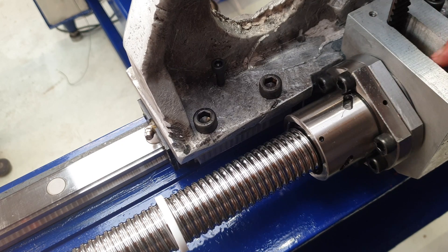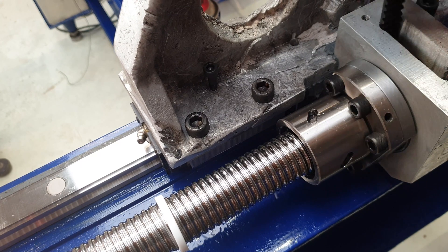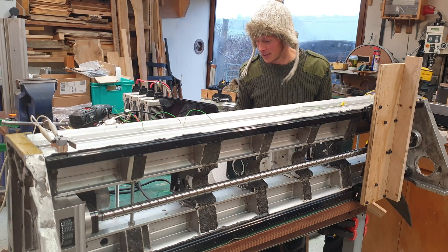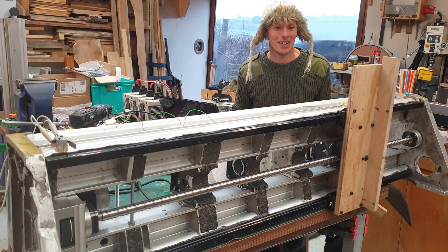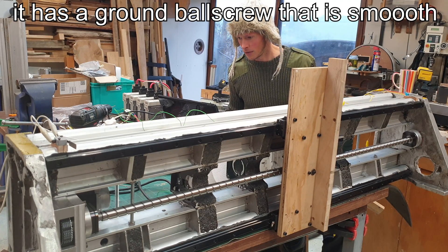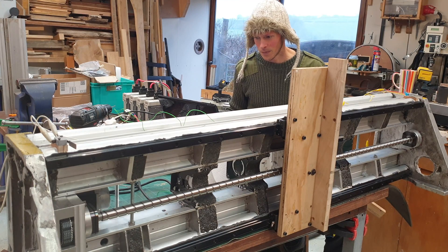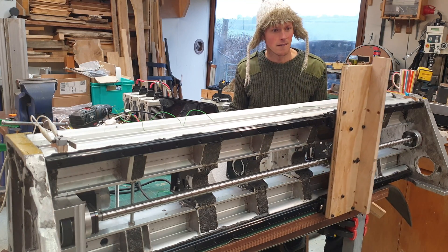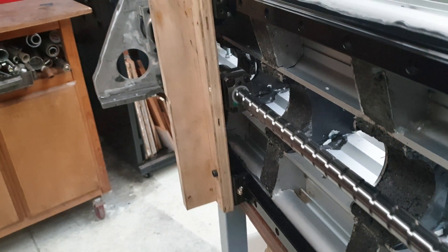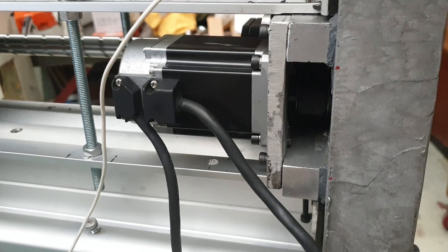If you look closely you can see those diverters — they really aren't very solid in their housing, so no wonder when the ball bearings are bashing into them at high speed that they sound a bit like a bag of nails being rattled around. It does feel quite a lot better. There you have it friends — two methods for tuning up the ball screw. I think the first one is a lot more thorough and frankly better, but as a word of caution I'd be very hesitant to take apart an expensive ground ball screw. I'm imagining that how and whether they go back together depends on the recirculation method, how much preload they have, and in some instances the balls are even ordered in different sizes. Do get in touch and let me know your thoughts in the comments — see you next time.